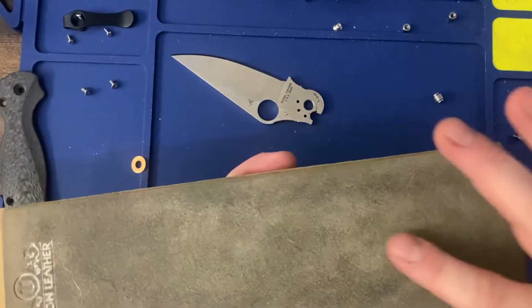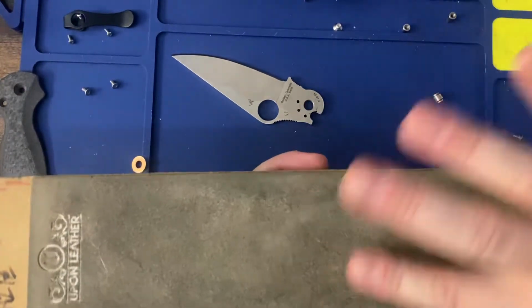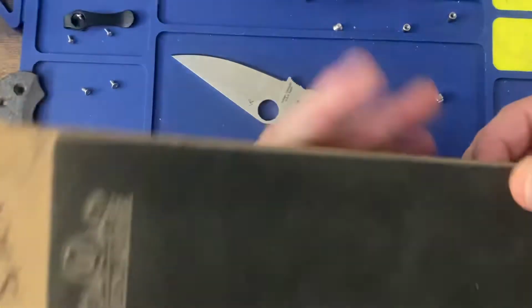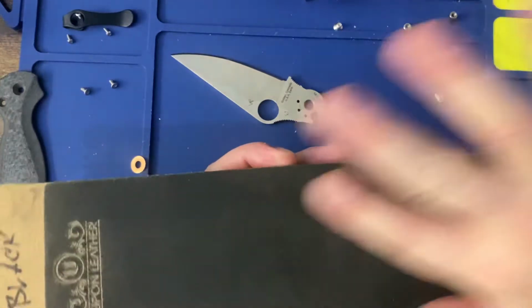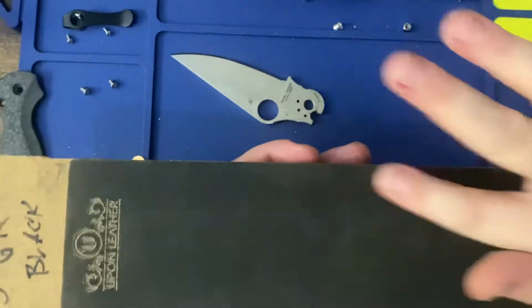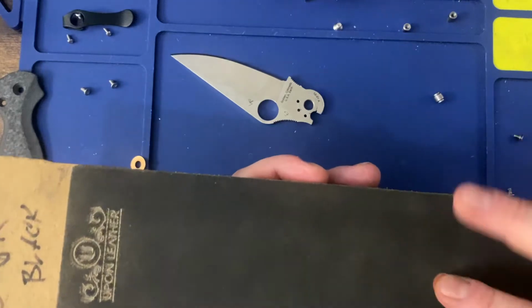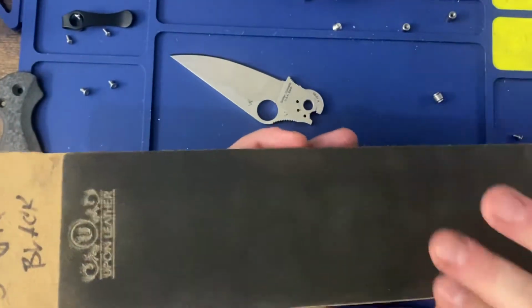about a 1 micron strop. And I just do a few circles on it. I have a 5K. This can be done more. I mostly want to try and get any crap that's on there off. I'm not trying to overly polish it. That's why I start at a high grade. I'm not trying to grind it down like you would an edge. I am literally using the strop abrasive to grind down all that crap that's on there while smoothing it out.